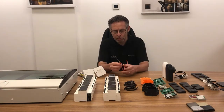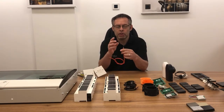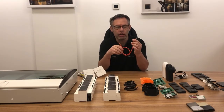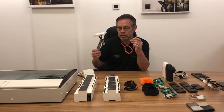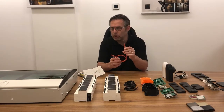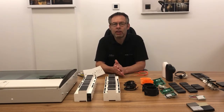With Niko Home Control on bus cabling, we can use any cable actually, but this is a Cat5 cable. It's a data cable, but we're only using 2 cores of it, so I'll show you how that connects later on. It's only 26 volts, which means it can go on the wall inside the bathroom, which of course we couldn't do with mains cabling because it contravened the regulations. But anyway, we'll get started. I'll walk you through the installation, and then you can see how easy it is to go together.